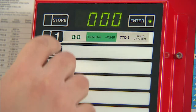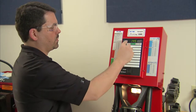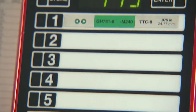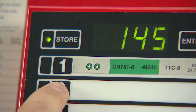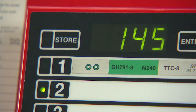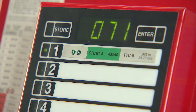The enter button is used to load any three-digit number into the display. The numbered keys have two functions: in the enter mode the numeric value appears in the display, and in the store mode they retain a display setting. The Pro-Crimp FT-1380 has a memory to retain up to 10 of the most common or frequently used fitting target settings. To store a number as a preset, press the enter button and enter a three-digit number within the five-second time limit, then press and release the store button. The green light next to the store button lights up when working in the store mode. Finally, hold down any one of the 10 numerical buttons for three seconds. When the green light switches from the store button to the numbered button and stays lit, the setting has been saved. To recall a setting from the presets, first make sure the store and enter lights are off. If not, don't touch anything and in about five seconds they will go off. Press the button corresponding to the storage setting you want to recall — that setting will appear in the display and you are now ready to make a crimp with that saved setting.